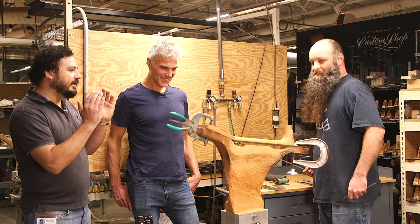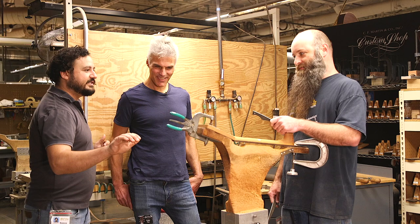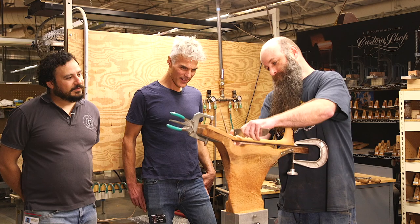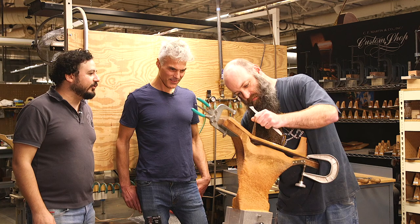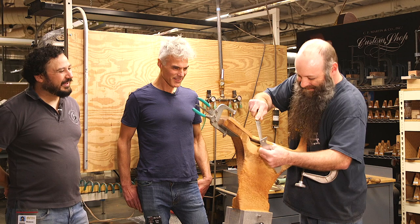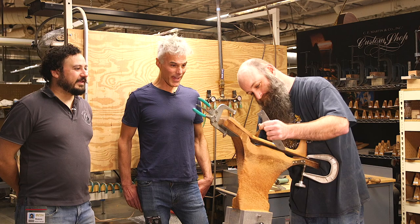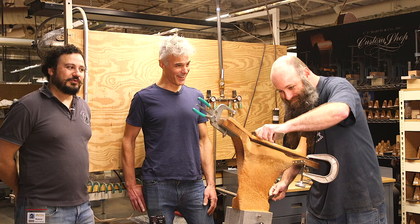The approach — if you watch — you'll see we're coming in on angles, maintaining those angles going down the barrel of the neck profile. Here's my gauge, and that's all the stuff I've got to take off now to make it round again — see all that meat. So we can actually scribe it. That's what Mike has just done. It leaves a little impression of the gauge. He calls that cheating. Take a little off, check it, take a little off, and never put it back. Once it's gone, it's gone — not very forgiving wood.